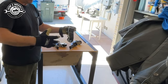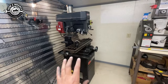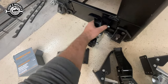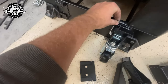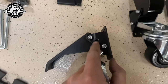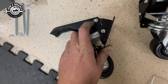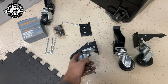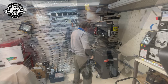That was super awesome — being able to lock it was great because it wasn't a very stable platform with a really small base and a lot of top weight. Here's that top-heavy mill. You take the caster and slip it into the bracket — on this one we welded them. Then you take the securing pin, which is quick-release, no tools required. Set that in place and it stops the caster from going out, then step on it to raise it. I drilled a hole straight through the movable and non-movable parts to lock it in place, then used a hitch pin from an everyday trailer hitch — drop it through, quick release, no tools required, and it keeps everything securely in place.